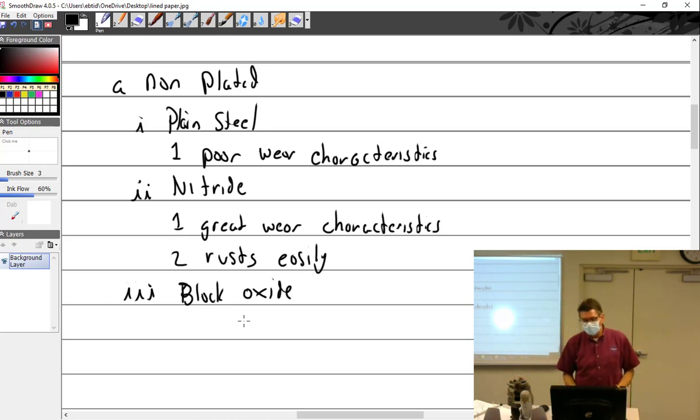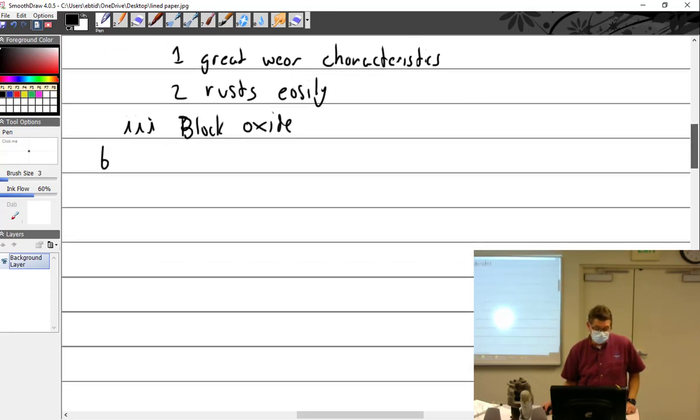So they actually color code theirs that are nitrided with a little blue stripe. And the ones that were plain steel, they didn't. So they actually had this distinction. And memory serves me, the way you actually told the difference between them, if you didn't know, is that the nitrided were choked and the plain steel were not choked. But Continental has never made a thing about it. Never really discussed it. It's just, that's our cylinder. Don't worry about it. I kind of like that. Like I said, Lycoming had some that were and some were not. The lower horsepower were not, the higher horsepower were.